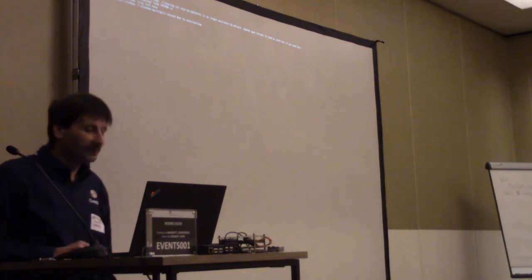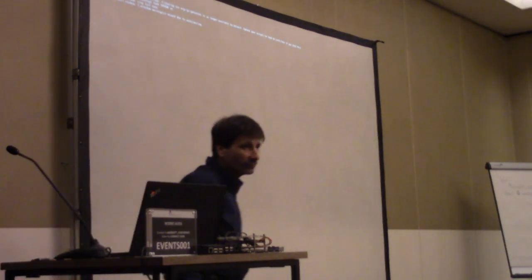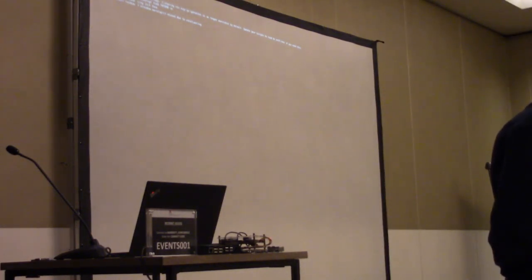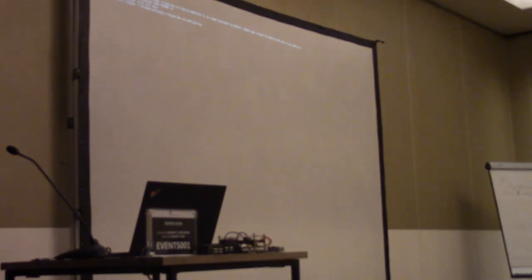Did you play about much with the GPIO capabilities, regarding also some tuning of the CentOS on the system for better near real-time behavior? Sorry, are you using these ARM boxes only as servers or also as hardware gadgets that can control things via GPIO pins? You need some timing, and you quickly hit the spot where you see Linux is no real-time operating system. But of course you can tune things, or perhaps there are some devices you have used that have hardware interrupts that can help you with timing.